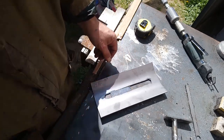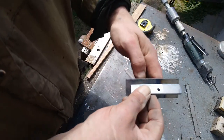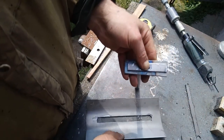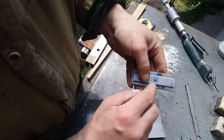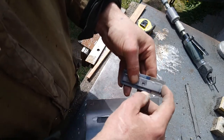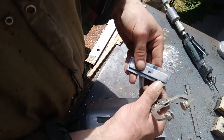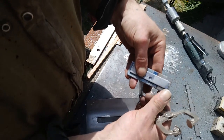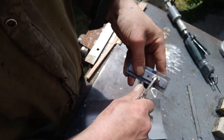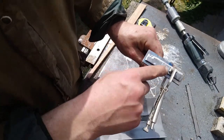So that plate is going to get welded onto that. I'm going to clamp that on there. Slightly rounded off the edges just so that that thing hopefully will slide a bit easier. I've drilled a little hole. I'm going to see if I can puddle weld that, get a little spot weld, whatever you call it, in there. And then just going to put a dowel on each end just to hold it in place, and get it central. That'll do. Tiny little clamp. I'll get a weld on each end, take clamp off. I can do that middle one then.